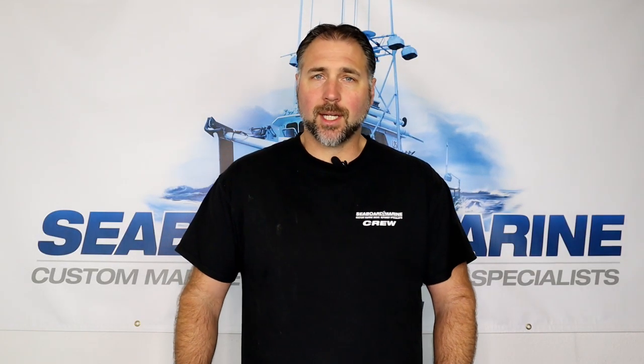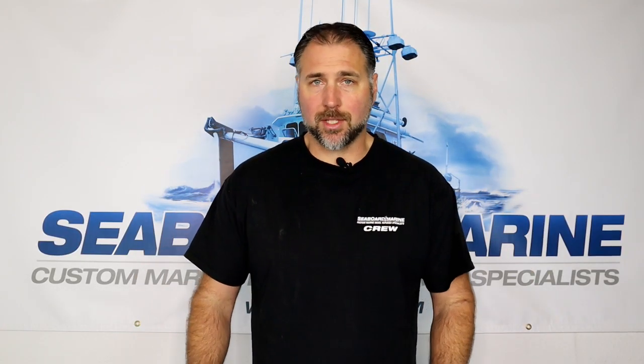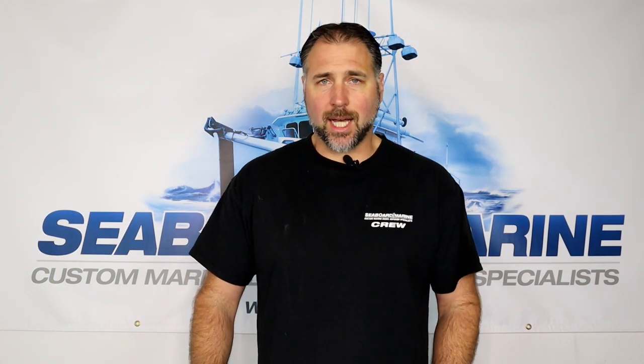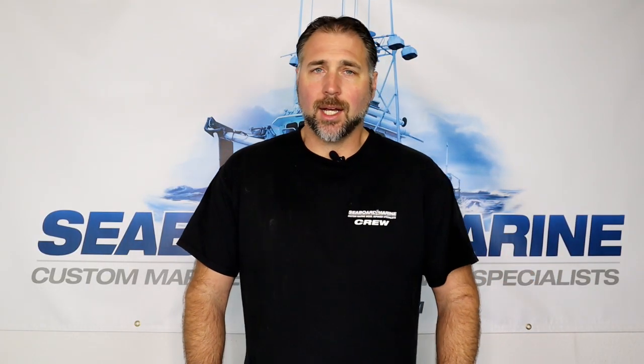Before we get into freshwater flushing, I'd like to talk about marine age, which is related to freshwater flushing. Marine age is a term that Tony's been using for a few decades to describe the sort of real pragmatic condition of an engine or an installation in a vessel. Boaters and engine manufacturers often use engine hours as a measure of the age of an engine, the condition of an engine, service intervals, things of that nature. And that makes sense for certain internal workings — oil changes, valve adjustments, etc. But when it comes to things like the raw water cooling circuit or other metallic parts of the vessel that may be static but are exposed to the environment, those things can tend to age completely irrespective of engine hours. And this is where the term marine age is very effective in describing that.